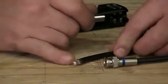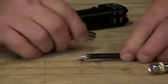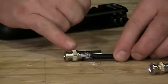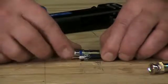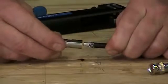We make a normal strip like we always do on these cables, which is our basic two-step strip we've talked about. I know that the center conductor has got to go up to about where the front of the nut is on the front of the fitting, so I know it's got to go in about that far. I'm going to take my finger and just kind of set it here in the back with my thumb, and I know the connector's going to be inserted that far.